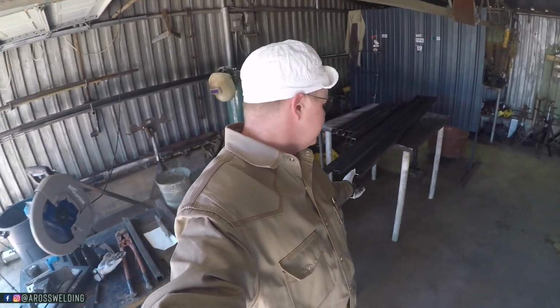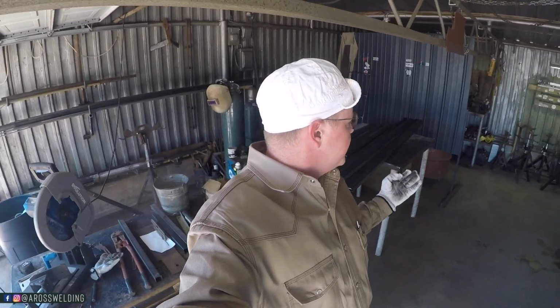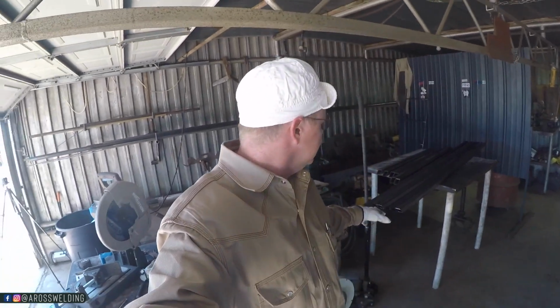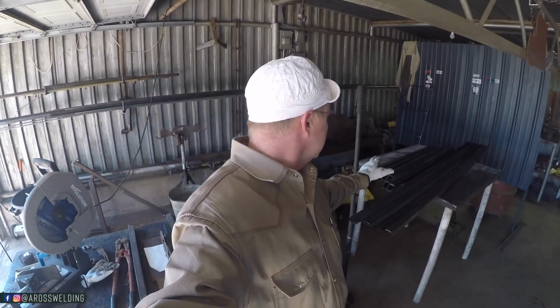You wouldn't always have to, because it's real simple, 1.5 inches. So you minus 3 inches is essentially what it's going to be, and I'd probably take off about a 1/16 roughly. So if I'd done that, it ought to fit pretty good. But it just kind of changes the pace too, because I've been cutting this for 30 minutes. What it's taking me to cut 6, 8, 10, 12 pieces, 45s on each end. So it took me about 30 minutes to do that.